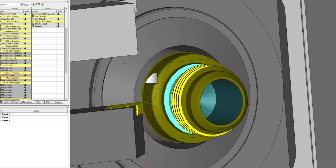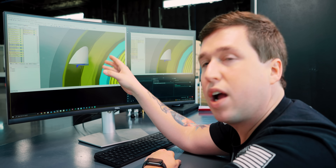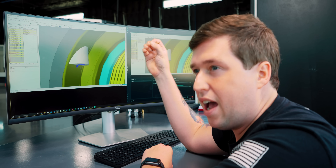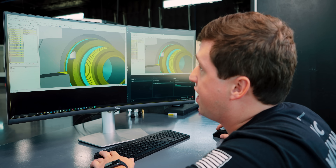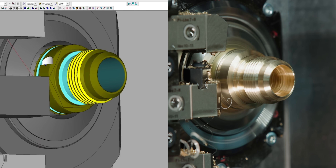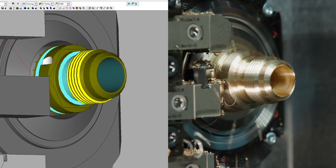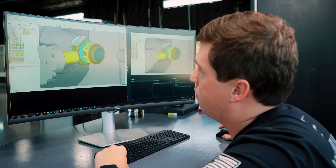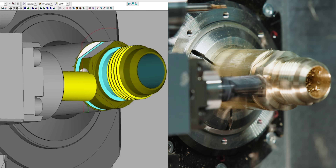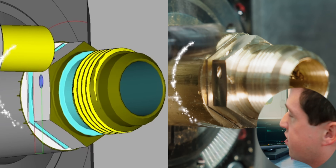Right there, you can see why we get bigger stock — you can actually see the drill might follow that and break out. Realistically the drill will probably be fine if you did it this way, but this is all about having the longest lasting process. Stuff like this can lead to problems. After that, I'm gonna come in and groove out behind my hex so that when I mill it, I can deburr it on the main spindle so it's perfectly smooth. And then when I mill my hex, you're actually gonna see these holes come to life and appear right before you — it's just magical.